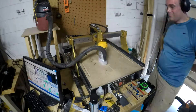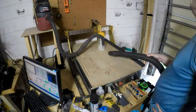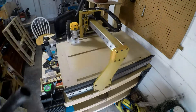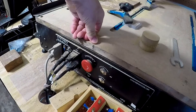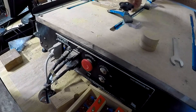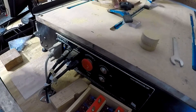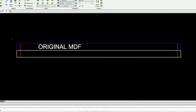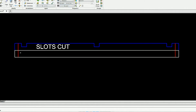To remedy this, I used a technique called fly cutting, which mills the entire table with the router itself. The idea is that by doing this, you're aligning the table to exactly how the router cuts. In theory this should work quite well, but there's something else going on — the middle of the table seems to have separated from its base. Perhaps warping could be expected given its location in a humid garage, but I actually helped this along by cutting several slots in the material in order to attach a set of clamping rails.